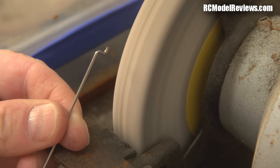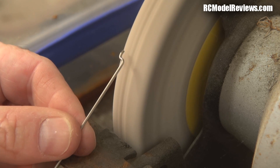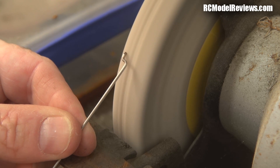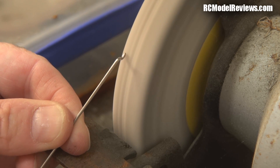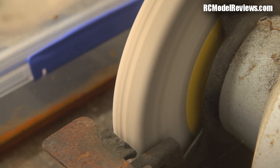You want to create a little bevel — kind of a chisel point — on that piece of wire up near the Z-bend, and then just take the diameter down a little bit by grinding in from the side. So you end up with a kind of chisel that's slightly relieved on one side, and that's going to be your improvised drill bit.